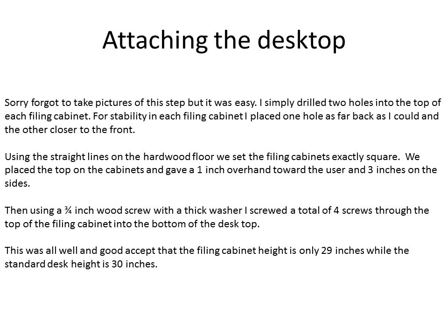Before we put the tabletop on it, however, we drilled a hole in the front top of the filing cabinet and the back top on both. Then we laid the board down, and then bought 4 3/4 inch screws with washers, and screwed up through the top of the filing cabinet into the bottom of the board.